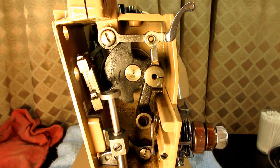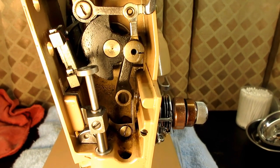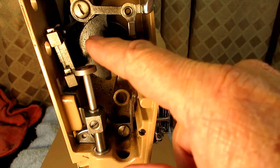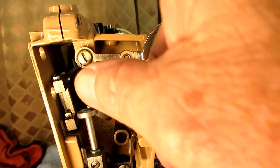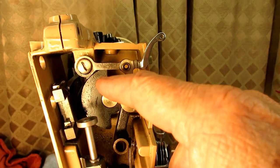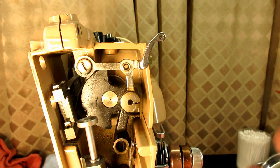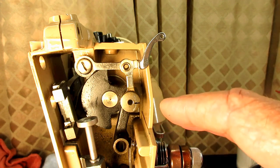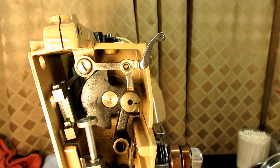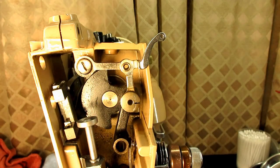To get this out, up on the top there is some access to the two set screws that hold this system in place. If you're looking at this and saying you don't see that on your machine, it's because I have the needle bar out, the needle bar vibrating bracket out, and the pressure thumb screw for the presser bar is out. If you don't know how to do that, in the description below the video I'll put a link to the playlist for the Singer Model 403, which includes all the videos for this machine including the needle bar, presser bar, and vibrating bracket.